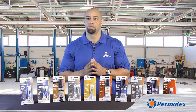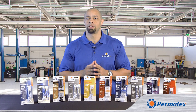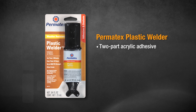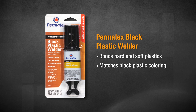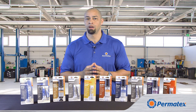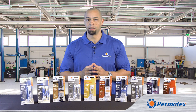In addition to our general purpose liquid epoxies, we've also got some special purpose adhesives. Permatex Plastic Welder is a two-part acrylic adhesive that bonds hard and soft plastics to each other and other materials. Our black plastic welder does the same, but lets you match the color of black plastics — it's actually the only true black acrylic adhesive available today. Both of our plastic welders work with a variety of plastics, but they're not designed to bond polyethylene or polypropylene.